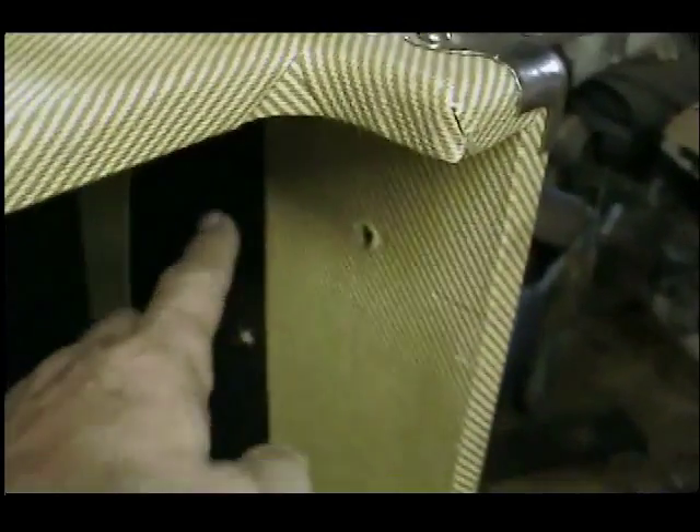The box is mounted and solid. The power cord will store in the bottom with the amplifier cord. I can use nylon ties around the amp power cord to shorten it up so it's not in the way. Now all I've got to do is put the speaker back in, slide the chassis back in, and make a mount for the fan. I was thinking of cutting a hole and mounting the fan to draw air from outside across the tubes.